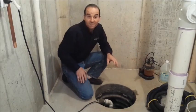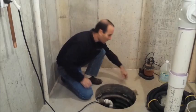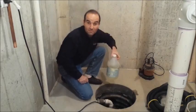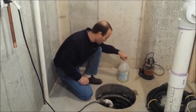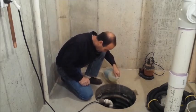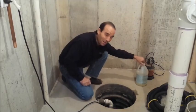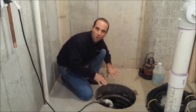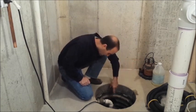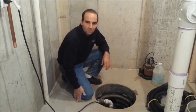Another thing to be aware of is that sometimes your sump pump will be kind of cruddy and gross — sometimes there will be bugs living down in there. A good solution is to use pool shocking chlorine. You can also use bleach, but we use the chlorine shock since we have a pool. I usually just pour about a half a cup in there, maybe a quarter of a cup. If your sump basin is dry, add some water first — maybe a quarter of the way at the bottom — then pour the pool shock in and swish it around a little bit. That kills all the bugs and different things down in there.